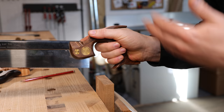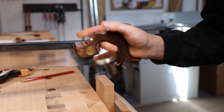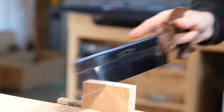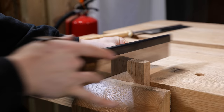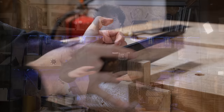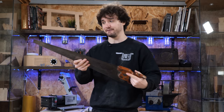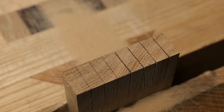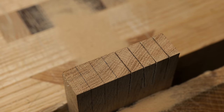Technically, your middle finger is all you need to grip the saw — the rest of your fingers are simply there for support. To demonstrate this, I can literally let go of the saw with all of my fingers and just let the saw do the work. This applies across all saws, whether a dovetail saw or a panel saw. The takeaway is: only grip a saw as much as you need to. Don't squeeze the living daylights out of it, because that will be incredibly uncomfortable and impede the performance of the saw.